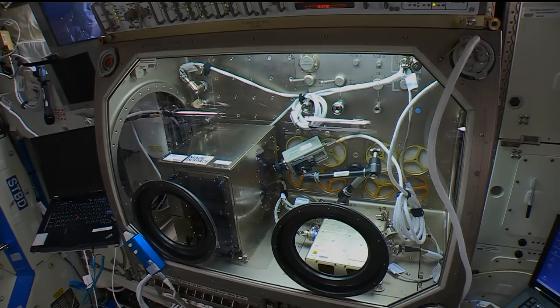It's really important — we're getting all the electronics hooked up, making sure everything's functional, and testing the commanding. The printer has two windows, and we're repositioning the MSG cameras very closely to those windows so we can monitor the actual extrusion process as the prints and the layers are being deposited — we'll be able to see that in detail. Then later on today, once all of that is set up, we'll actually print our first calibration coupon, probably a couple of these, as part of the functional checkout to make sure everything is functioning correctly and the machine is calibrated before we go into full operation.